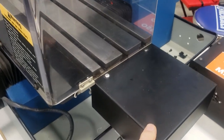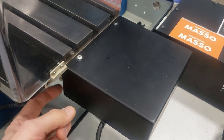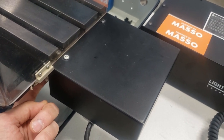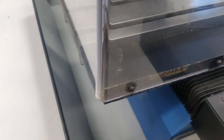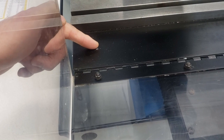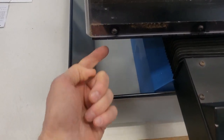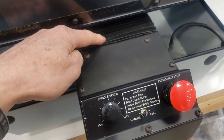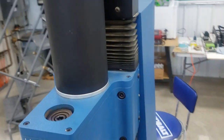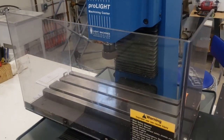In addition to this motor here, underneath this magnetic switch is a micro switch — that is the right stop, and we probably won't be using that. When you come around here, you can see two screws in the bed. Underneath this table is a micro switch, and that is your X-homing switch. So you have your X-homing switch here, your Y-homing switch here, and your Z-homing switch up here. It's just a matter of determining what those are.